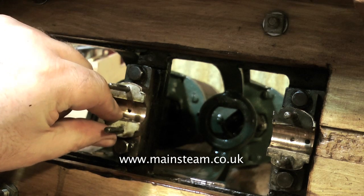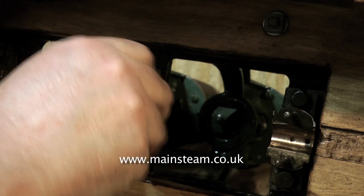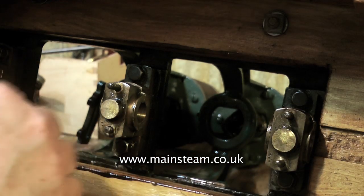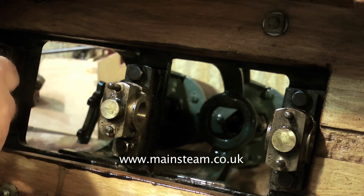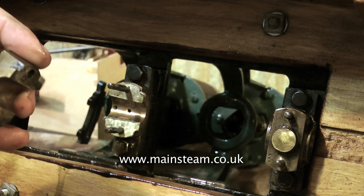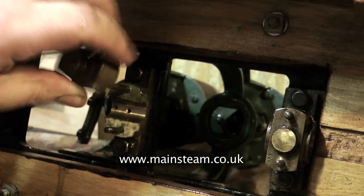As you can see there are quite a lot of shims on the main bearings, as I mentioned earlier. For the moment I'll just put the end caps back on in the right position and think about this later when I come to put the engine back together. Hopefully very soon I'll get rid of this really crappy box it's mounted on and get it on a special base I'm going to make, so the crankshaft will be more visible when the engine is running. With the crankshaft safely out of the way, I'm temporarily putting back the lower bearings in the right place and putting the nuts on — not tight, just to hold them in place so I don't lose them.